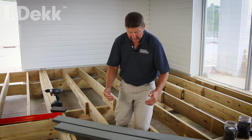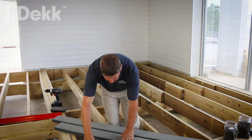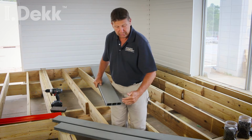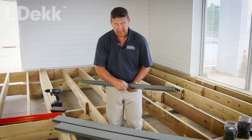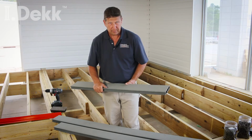So after I do that, I'm going to pull each successive board in. And while we use 2 1/2 inch screws here, when we're working backwards towards a corner like this, we can use shorter screws down in the lip here. As long as we don't overdrive them, and in a limited capacity, we can do that. So that's what we're going to do.